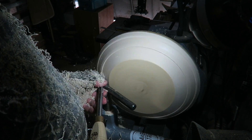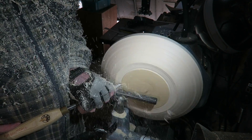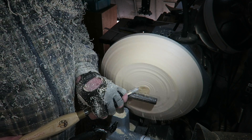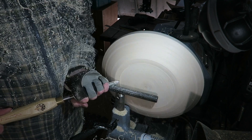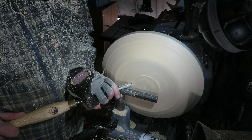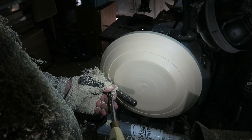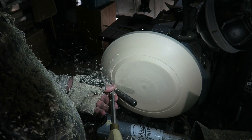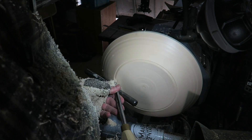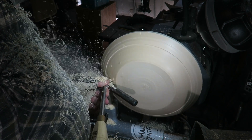It's been a while since I've been on the lathe so I felt a bit rusty again as usual. There always seems to be something keeping me out of my workshop these days. Anyway, here we are back to just truing up the base with a push cut, gradually removing the stock and getting it all nice and true. Getting back into the swing of it, gradually creating that nice curve. There isn't going to be an actual foot on this — I want it to just be a nice smooth curve disappearing to the underside.